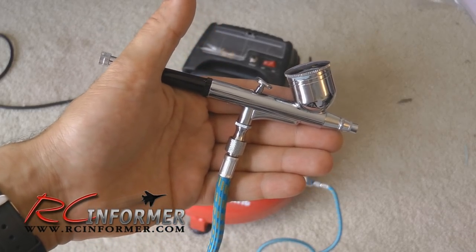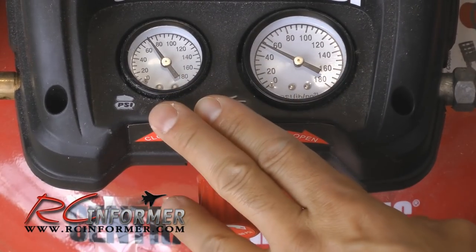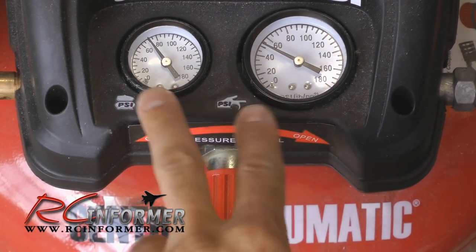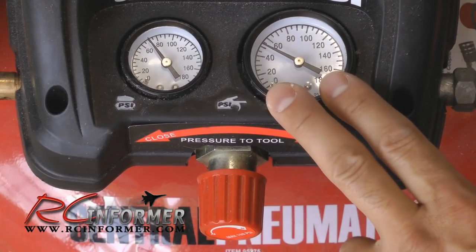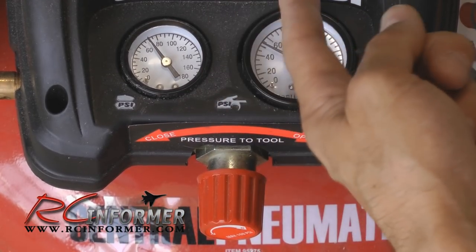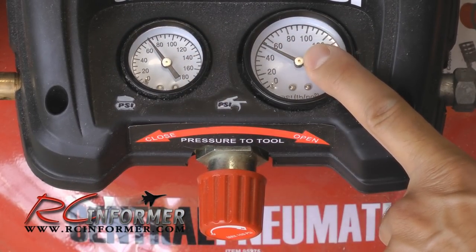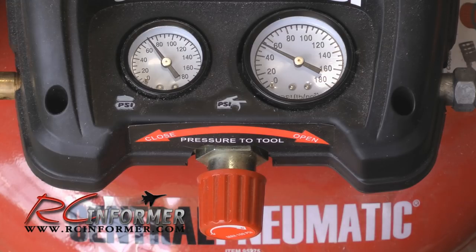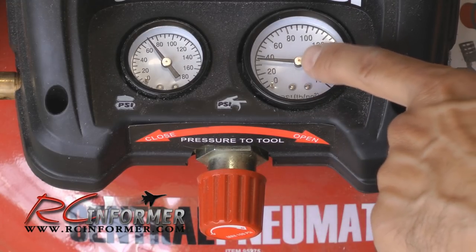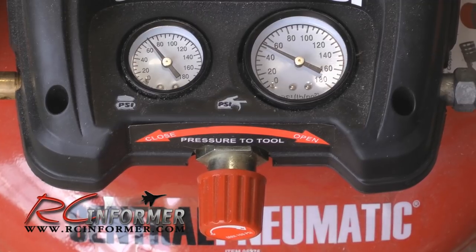Here's how you set up the compressor pressure. Operating your compressor for your airbrush is pretty simple - you only have two gauges. This gauge shows the tank pressure and this gauge shows the pressure coming out of the airbrush itself. You can put a hundred pounds of pressure in this tank. Right now I have seventy pounds in the tank but I only want thirty-five coming out of the airbrush. When I press the airbrush button down you can see it shows the actual pressure coming out, which is at thirty-five pounds. That seems to work well for me.